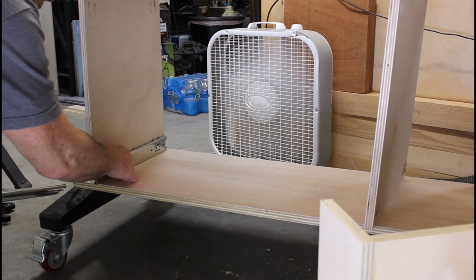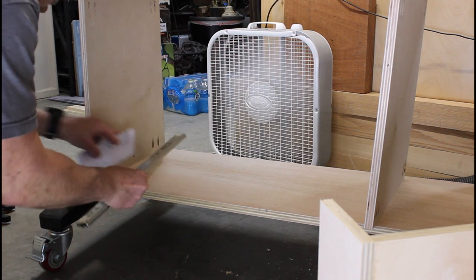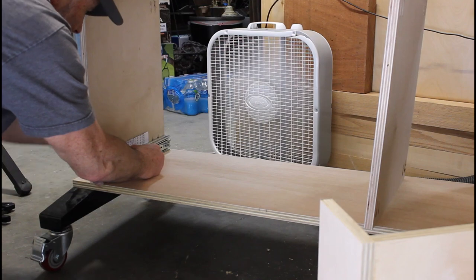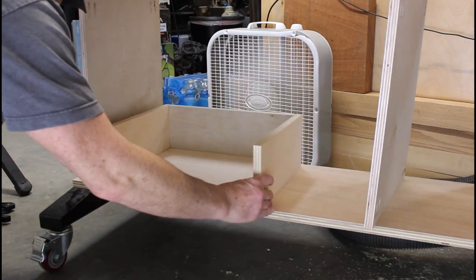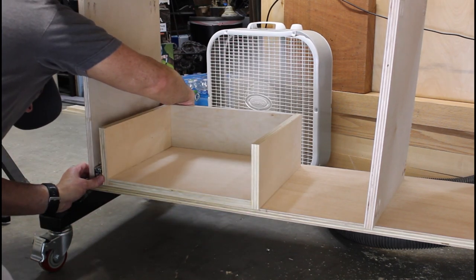When assembling cabinets, here's a neat little trick that'll help you determine exactly where to put your cabinet dividers. Place both drawer slides side by side here and include the folded instructions that came with the drawer slides. Now this will add an additional 1/16 of an inch wiggle room. Place the drawers right against them. Now you have an exact location to place your drawer divider.